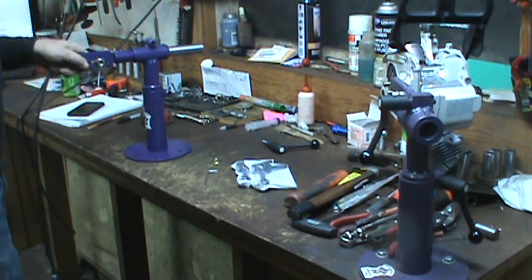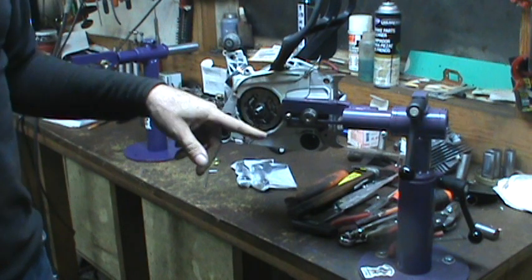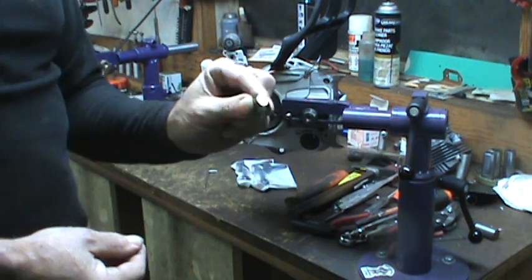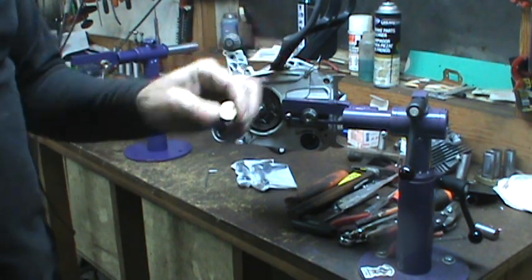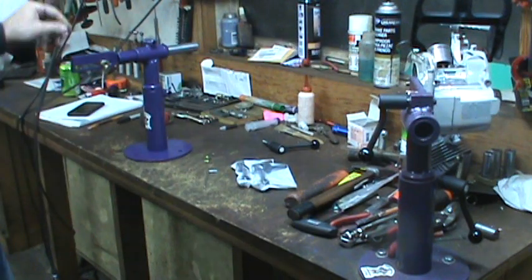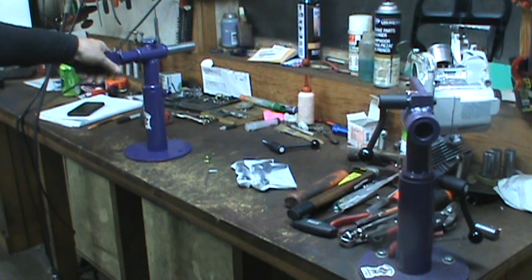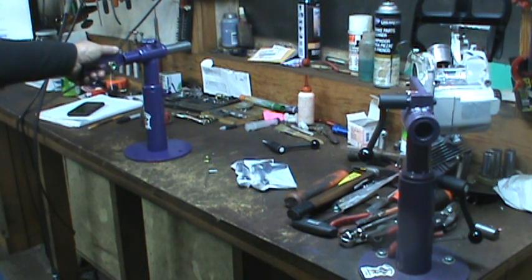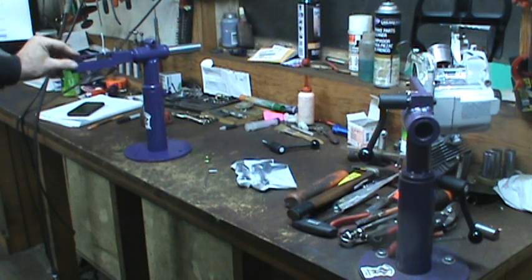This is the top side — mount the saw on this side just like you see here. I've just been using one bar nut and a washer, but this style bar nut comes with a washer on it, which is what I'm sending. I think this is a better bar nut for that. This is a 13-millimeter and fits all of the metric saws other than the 880 — though it is slotted for an 880 mount. Everything else is slightly loose in it but mounts just fine. You don't have to remove your chain tensioner or adjust your chain tension to any specific position.